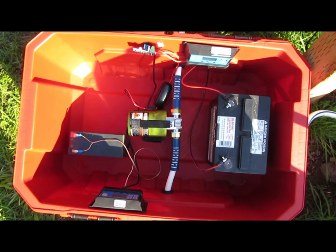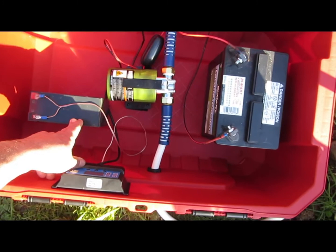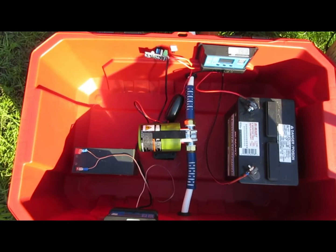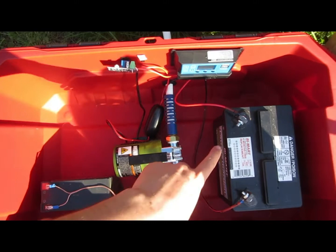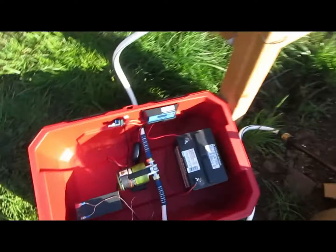There are two separate circuits working here. The first one starts here — the solar panel plugs into this controller, which charges a small battery. This small battery operates a wireless relay, and the wireless relay allows me to connect this system to my WiFi so I can control and operate it from my phone. Once that relay is turned on, it completes the circuit from this battery to a 12-volt pump, which then operates the drip line system.